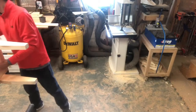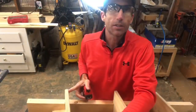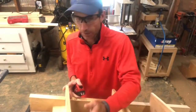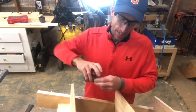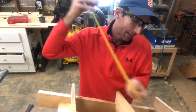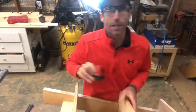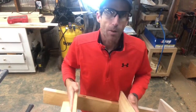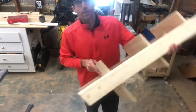The shelves are all 13 inches long, so from here to here is 13 inches. You could probably subtract that to 12 inches, because that would help out just a little bit. Then this one is 12 inches wide, this one is 10 inches wide, and this one is 8 inches wide. The reason 12 inches would work out a little better is it's just a better use of materials, but with the length we had we could go 13 inches, so you can customize this a little bit.